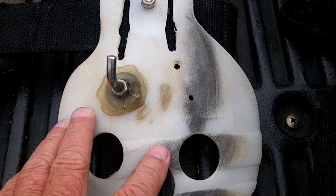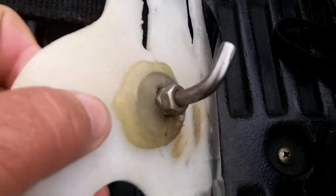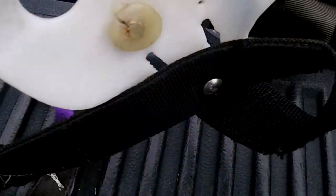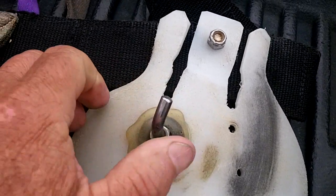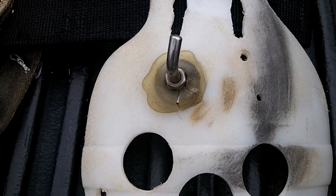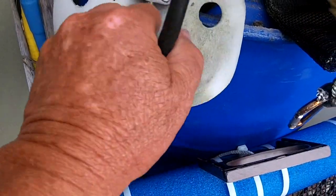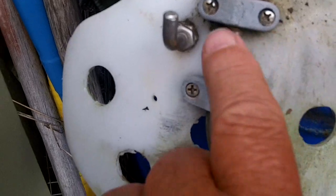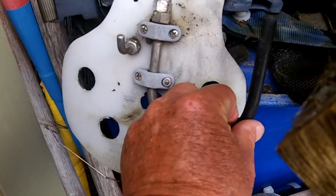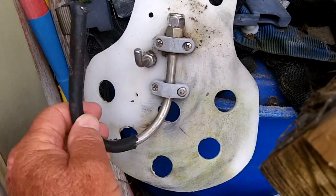The plastic barrel kept the scoop from dragging and hitting against your leg — it would rub right here. We took a stainless steel bolt, stuck it in there, turned it over, heated it, and bent it. But we could never get it to really stay firm; after a while it would move around. Then some of us added a stainless steel u-bolt so we could close it up, hang the scoop on it, or cradle the scoop in there — and it worked really good.